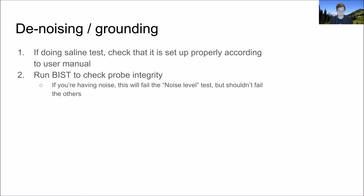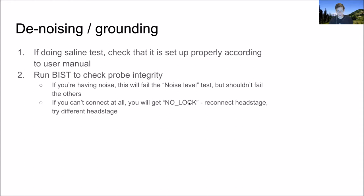Another common result on the built-in self-test is 'no lock,' which appears for many of the tests. That means you aren't connected with the probe. What you do is reconnect at the head stage — pull out the flex cable from the head stage, put it in again, flip down the connector, try again. Some head stage and probe combinations can be really tricky to connect. No lock almost certainly means that particular connection is not working, so keep trying or get a different head stage.